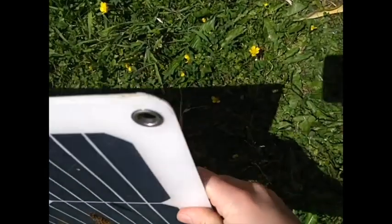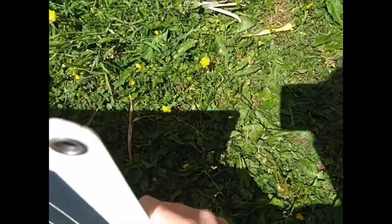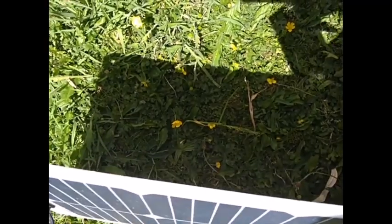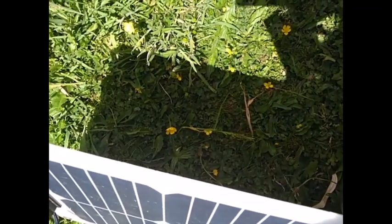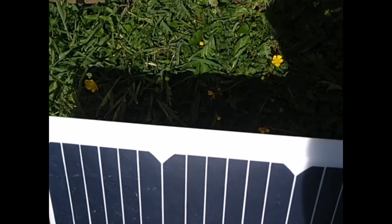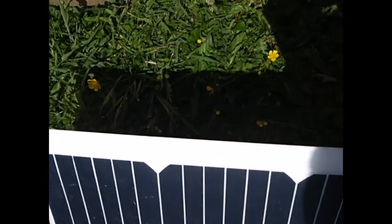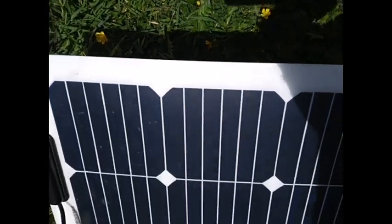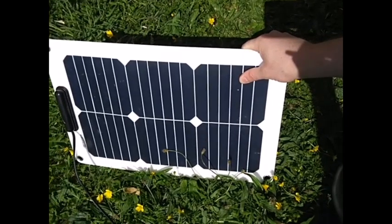Pick up the panel and you can see behind the panel is a shadow. Turn the panel around until the shadow is in line with the panel — about there — then tilt the panel back until the shadow is the longest on the ground. You see the shadow getting longer, now shorter, longer, shorter — so the perfect angle to have the panel is about there.